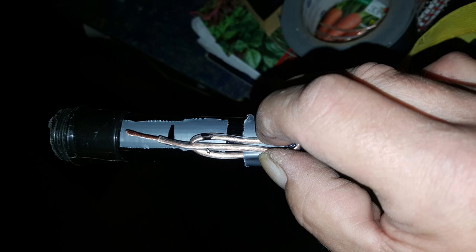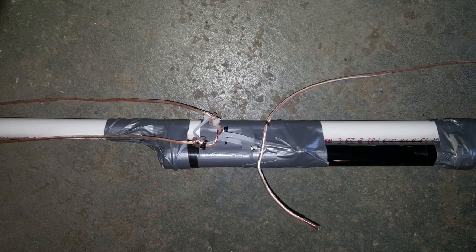Because this is the vertical radiator, it runs up this way, okay? Not knowing what the resonant frequency would be, I didn't want to have to add more wire onto this thing. You know what I mean? It's easy to remove wire, but to add it, you're going to have to do splices. So I made it too long, a few inches too long, and I just folded it back on itself. And that's fine. That removes that length of wire. You can do that. And it doesn't look like it in this picture because of the parallax error, but this ends at the line. Yeah, so anyway.